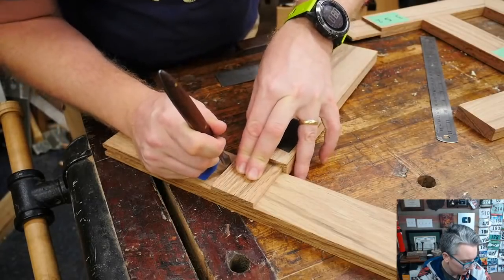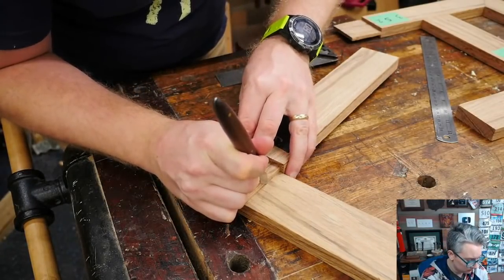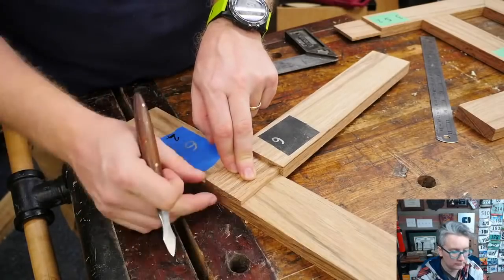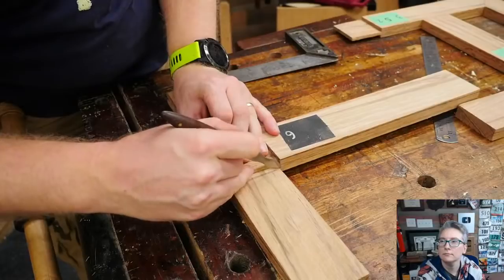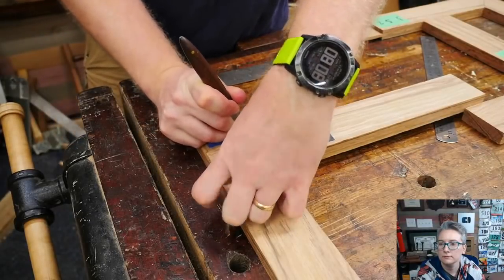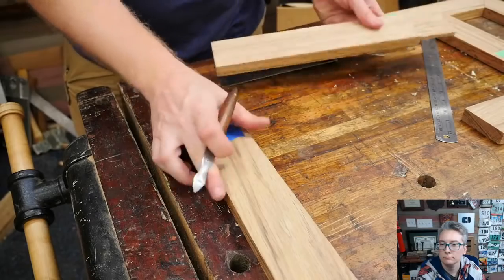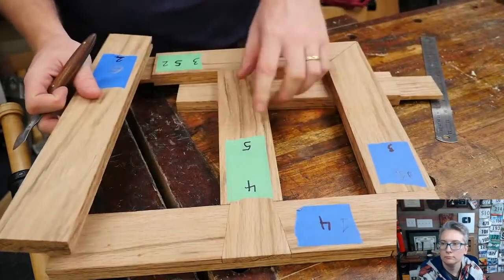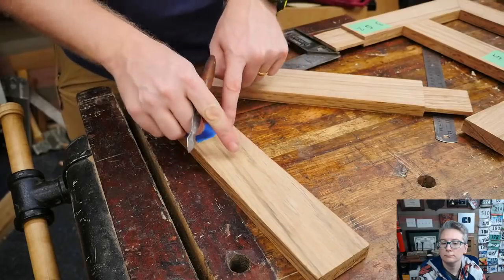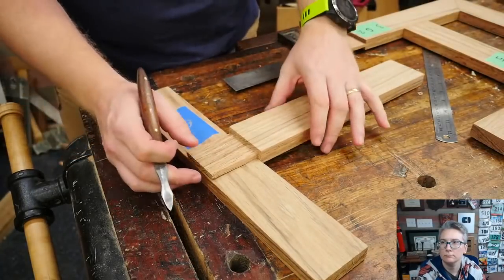It's about a sixty-fourth less, so I'm going to set it right there and put a little nick mark on the shoulder — not on the tenon, just on the shoulder — and do the same thing on the other side. I want to know where this board goes width-wise. This mark on the edge is the most important mark on this whole thing because it will eventually get transferred over to the intersecting board.